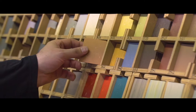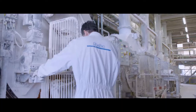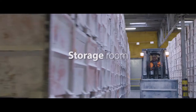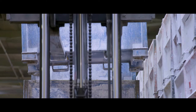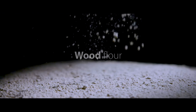At the start of the process, linseed oil and natural pine rosin are mixed together in large boilers. The linseed oil absorbs oxygen and together with the rosin creates a flexible binder — the result of which is called linoleum cement. The linoleum cement is collected in containers and stored in a heated storage room, remaining stored for 10 to 14 days until it has reached the right level of consistency and elasticity.